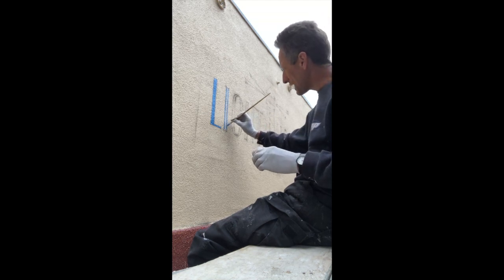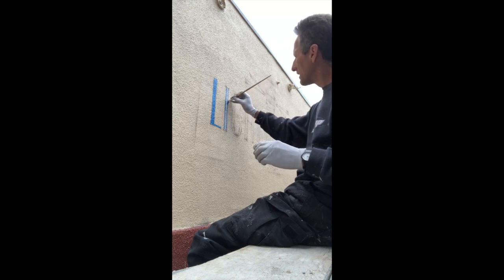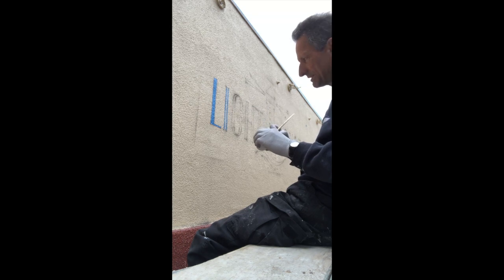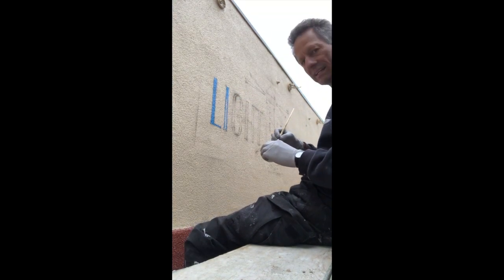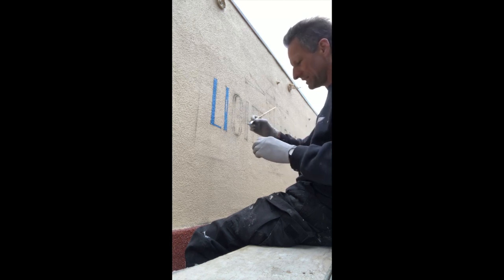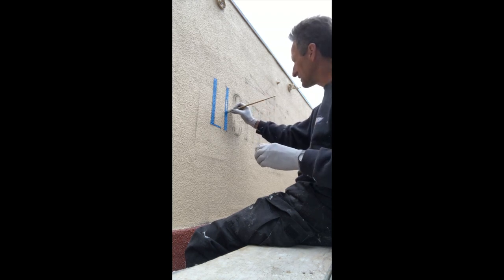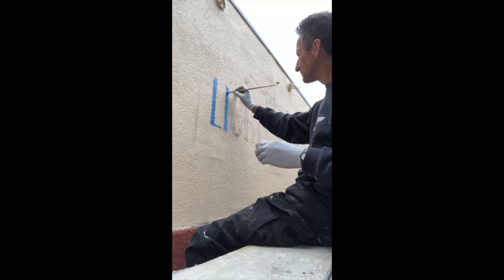Down, back up. All the holidays, also keeping it from dripping. Since this is freshly painted, I'll have easy access to touch up paint. I try to look back and catch it as I go, see if there's any drips coming down. I catch it with a rag and some lacquer thinner — knock it out of there and then touch it up again. Sometimes I'll miss it and then have to come back and grab some of that touch up paint.